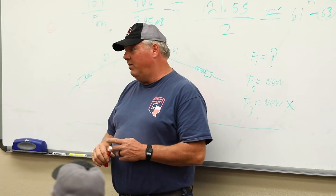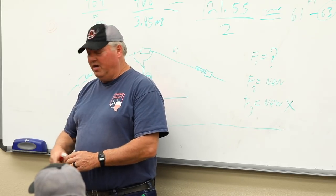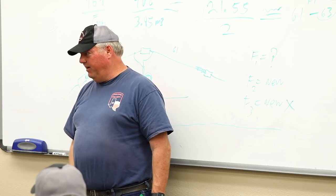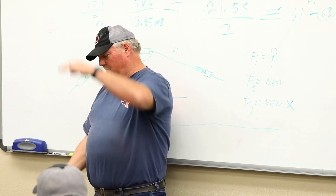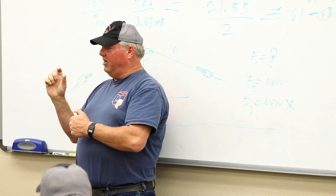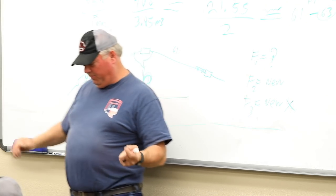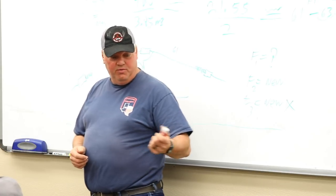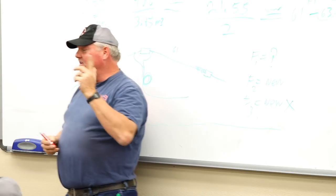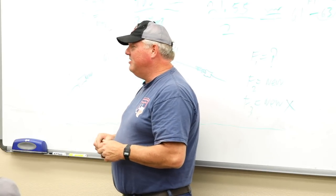And what I did at my house is I took a 4x6 pressure-treated post, like a fence post, dug a hole, and put some fence post concrete in there, let it dry overnight, and then I drilled a hole about this far up on the thick pipe, right? And I used a half inch galvanized bolt, went right through it, I lean it over, put on my hardware, make it up, I walk over, and if I have a friend to help me, he has a push-up board with a V in it, and he pushes it up, and I pull it down, and it goes whoosh, and now it's freestanding 30 feet.